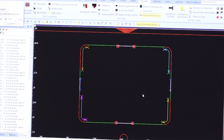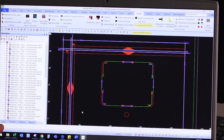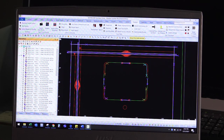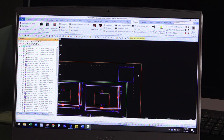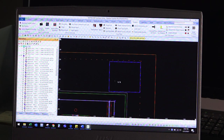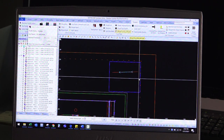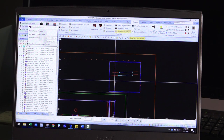Now that's cut out. On the left-hand side here, I'm going to move my incremental router so it's first in our operation. Lastly, whenever you're cutting this material, it's not a bad idea to open up those diamonds every once in a while. I have a small piece of quartz sitting on top of the table so I can take some manual cuts. I'll take my blade cut by two points and just do a couple of rips in that quartz halfway through the program, to get those diamonds opened up and keep my blade from glazing.